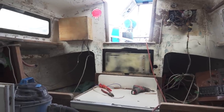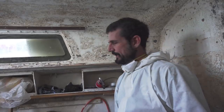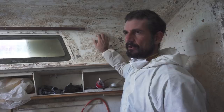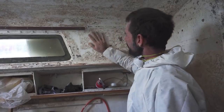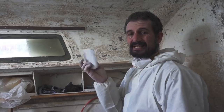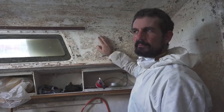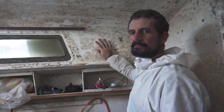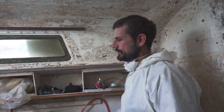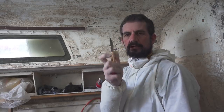We've heat gunned and stripped paint off, used the orbital sander and the little detail sander to get just about everything off that was anywhere near flaking or not substantially holding on. Now I'm just going to go through with some 80 grit hand sanding paper, because machines are great on a flat surface, but behind me there are lots of divots — it's quite a rough finish, the old Klansman. I'll go through and hand sand, wearing my glasses and keeping a scraper handy for any little flecks.